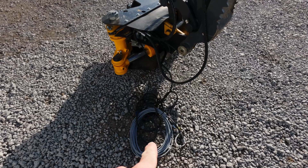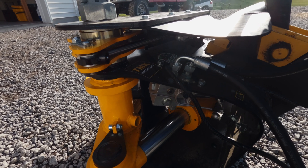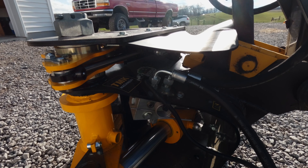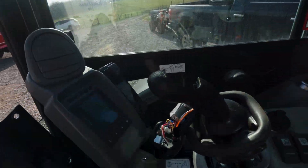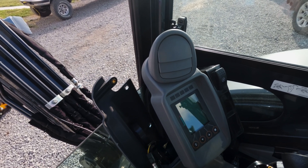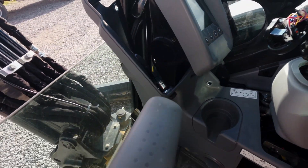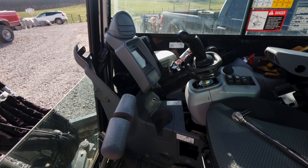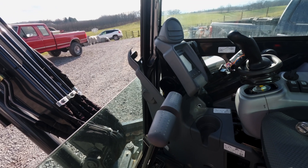What I have to do today — I've got all that cable on the ground. There is an electric solenoid that operates the bunching part of it, and I need to get that electric into the cab. What I'm going to do is have the electric go to the horn switch that's on the joystick. I'll have a selector switch that mounts right there where I can select between the horn and the buncher. It'll be actuated by this button right here on the joystick that I already took apart. I already got started and I'm working backwards — I know where I want to put the switch and what wires the switch has to activate. Now I just need to figure out how to get the wire from the implement up over the boom into the cab and get it wired in properly.